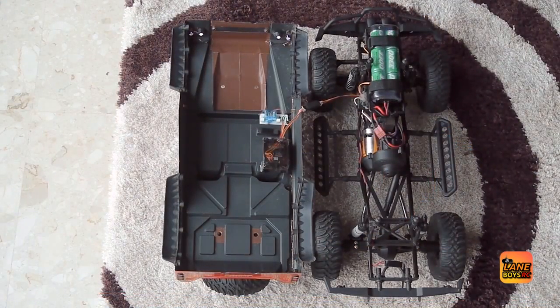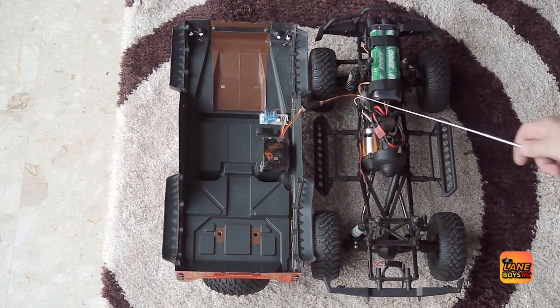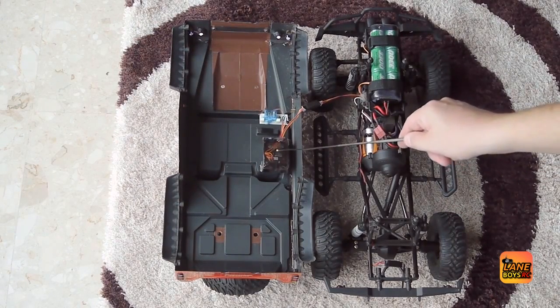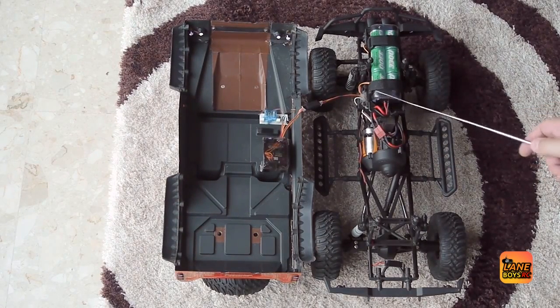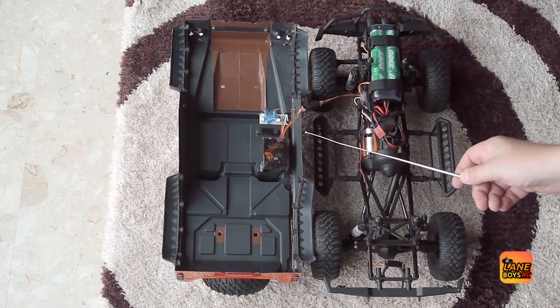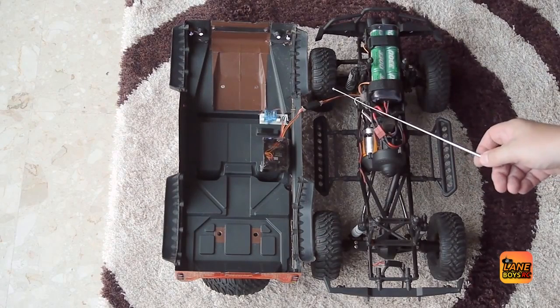The system is set up in a master-slave configuration. There is one piece of electronics in the receiver box of the XLSC X10 chassis, just under the battery, together with the receiver. This is basically the brain of the whole light controller unit. It reads the steering servo, the throttle channel, and channel 3, and processes them accordingly. It also controls all the lights in the bumpers of the chassis on the front and the back. There is then a single servo extension cord between the chassis and the body that transfers power and the control signals to a secondary light controller. The secondary controller is actually the same electronics as the main master, however it contains a different firmware. The single cable makes for a very neat cabling process as well as easy to take apart in the field and to maintain.